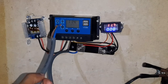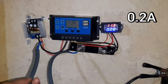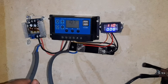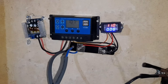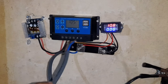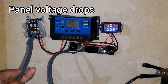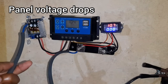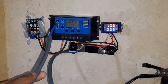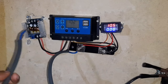We were able to get a 0.2 amp improvement in efficiency. That may not seem like much, but considering our case — it's a 150 watt panel rated at 18.5 volts — what usually happens is once the load is attached to the panel, the panel voltage also comes down. Likewise with this buck converter. Obviously this is not an MPPT, but since the panel voltage also comes down, we are able to get a slight improvement in efficiency.